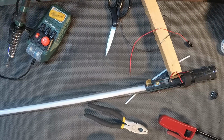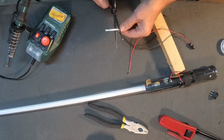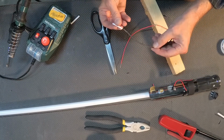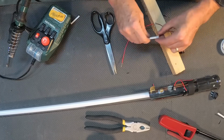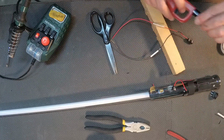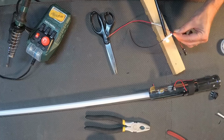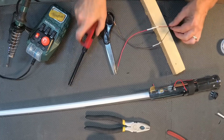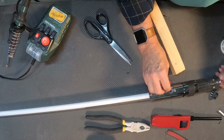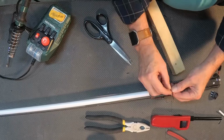After I soldered it, I'm also going to use a piece of shrink tape that comes in tubes. You can buy this, and I'll put a link below for these too. And you just slide this over your wire and slide it over the top of the exposed wiring, and then all you have to do is apply a little bit of heat. I'll just use this little torch and just heat that, and it'll shrink right around and protect your wiring. That'll work fine. Now I have enough extra wire that I can push that through and feed it up through the on-off switch hole as well. So now I have all my wiring into place.